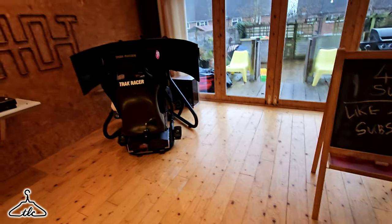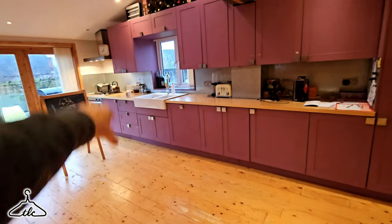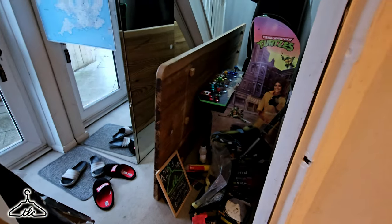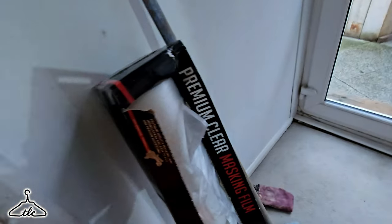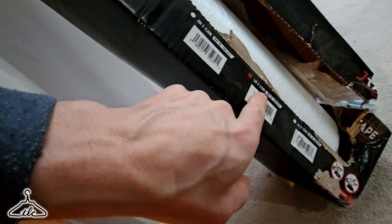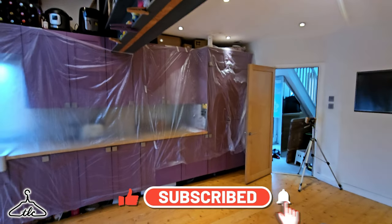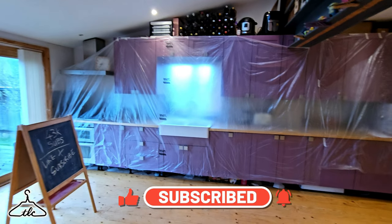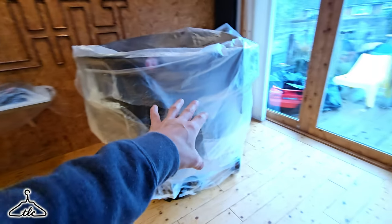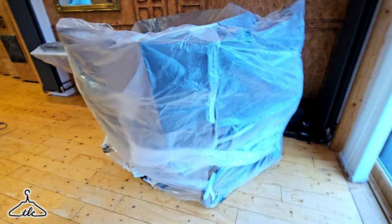I think I'm going to remove the threshold. I just need to ping off the skirting pins, wrap up the decks, and maybe put some plastic over the kitchen. All the stuff that's out has filled up my front room. We're going to be using masking film — it comes in a massive roll, 5 metres by 120 metres. The prep is done as well as I can be bothered; it's just to catch all the fine dust, and this stuff does attract it.